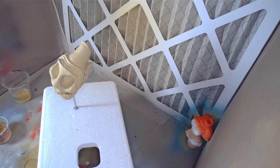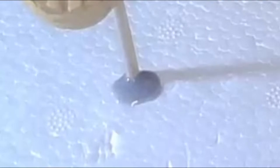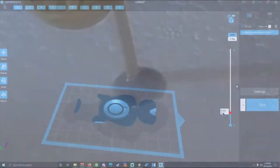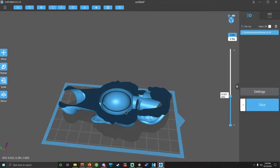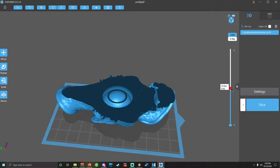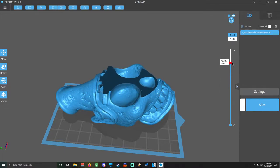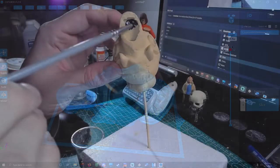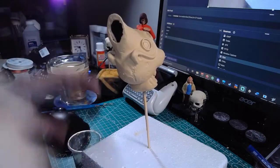It was at this point that I discovered an issue with this particular print. As the print was made as a whistle that would function, it does have a ball inside of it — this ball is hollow. And if you've ever printed anything in resin, you know that if you have any pockets, resin can get trapped inside. So for this particular print, unfortunately, it began leaking resin even after it was cured. As a word of caution: if you ever download a free 3D printable item and you're going to print it in resin, just make sure that it doesn't have pockets in it. Whether you need to find a different version or edit it yourself, it's always good to make sure you don't leave any spaces where resin can get caught and then leak out later.